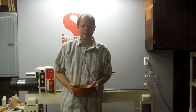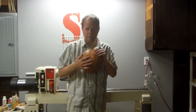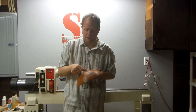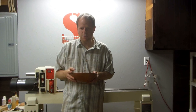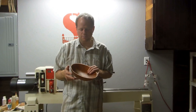Okay, this video is getting a little long, so I'm just going to wrap it up here. So just as I said, I put a little detail here in the bottom, maybe you can see, and did some sanding, brought down the nub to get it off, and hand sanded the little bottom here, and then cleaned everything up, put on a coat of walnut oil, which is going to dry now, and then maybe in a future video I'll show the buffing stage.